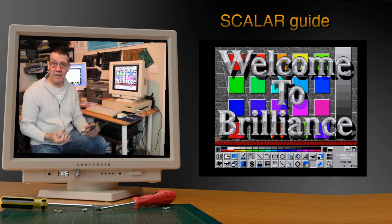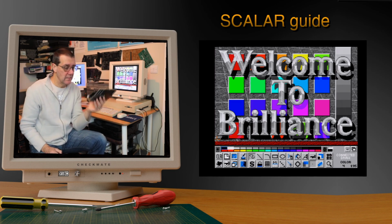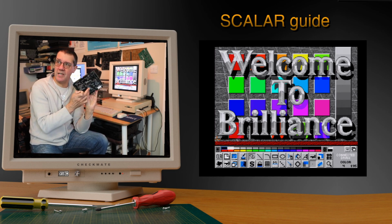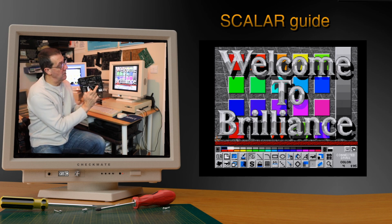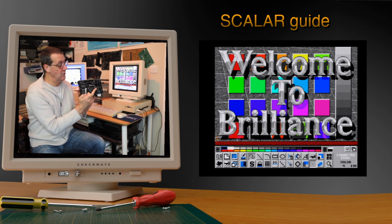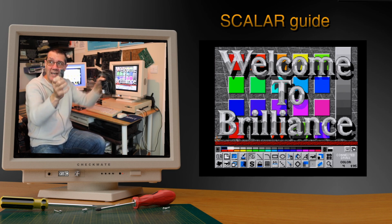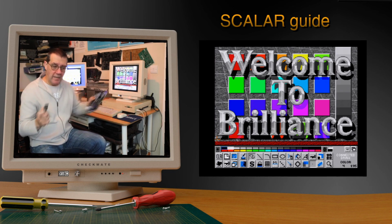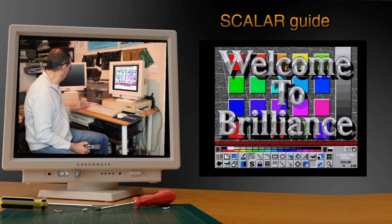If you want to take this board out on the warranty, look, this is designed for makers, okay? But just be careful when you pull the board out, okay? If you've got the S video and you've got the cable, don't yank it out and rip the board to bits with the cable. The only cable connecting this is the HDMI, goes to the Scalar. Pull this out carefully, okay? It's got little handles, you can pull it back, because as you can see, this doesn't have the frame on it. Pull it out gently, disconnect the S video cable if you've got it, and then just pull it out and you can do it. So that's the main thing with the Scalar.